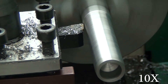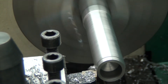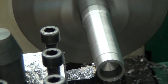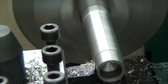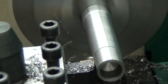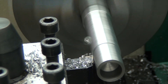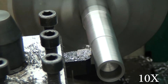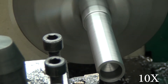When I was making the 10 thousandths cut, I was getting a really awful rubbing sound, and it got better the closer to the chuck that I got. At 20 thousandths there was maybe half as much of the cutting distance giving me the same rubbing sound. At 30 thousandths almost no rubbing, and at 40 thousandths no rubbing. I think it must be true what people say, that carbide likes an aggressive cut, because not only did the rubbing sounds go away the deeper I got, but also the finish seemed to get a little bit better. The 40 thousandths finish is one of the best finishes I've got while cutting hot rolled steel so far.